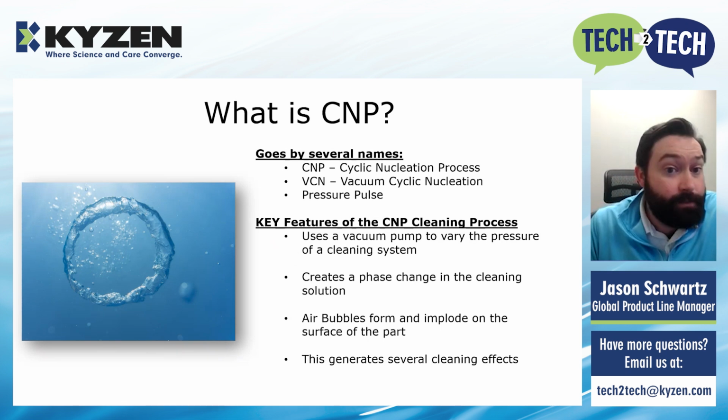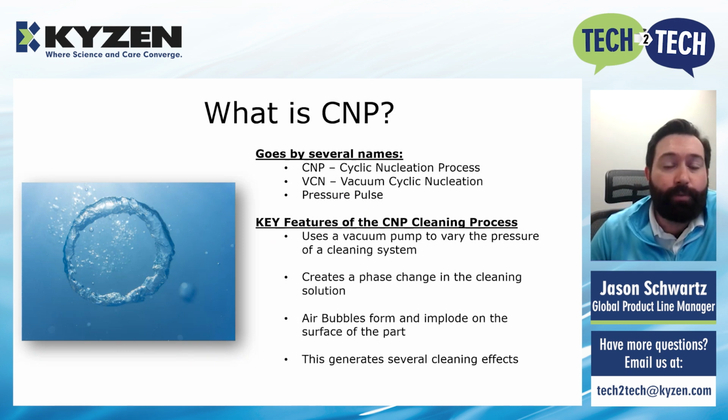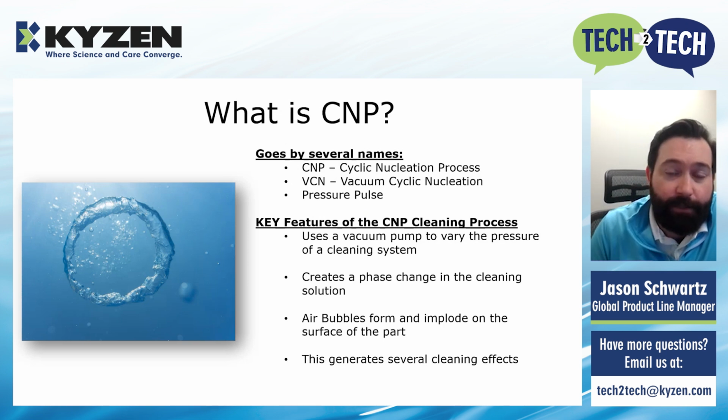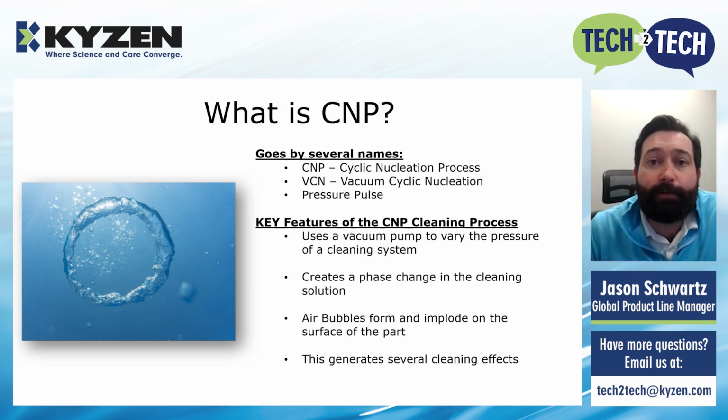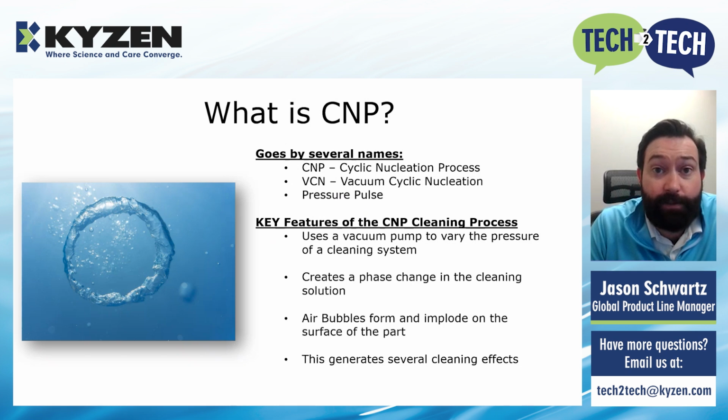So it goes by several names. CNP, which stands for Cyclic Nucleation Process, VCN, Vacuum Cyclic Nucleation, or pressure pulse, depending on which machine manufacturer you're talking to. But they're all talking about the same thing. The key feature is a machine that uses a vacuum pump to vary the pressure of a cleaning system, specifically in the work chamber. Some of these vacuum systems are already on the market, but they pull a stable vacuum. This is where the cyclic part comes in. You're varying the pressure, cycling it between low and atmospheric pressure.